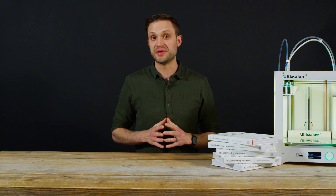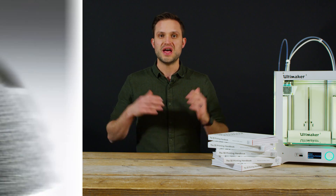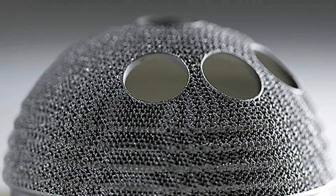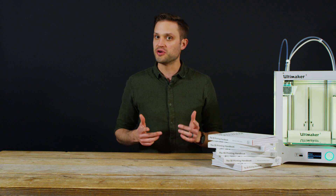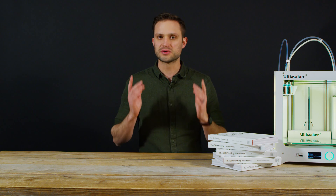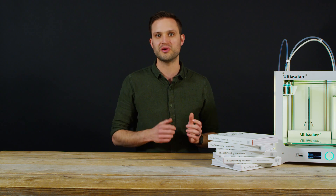So let's do a quick recap. Metal 3D printing is an industrial process best suited for complex high performance parts. It offers a lot of design freedom over traditional manufacturing techniques and you get all the benefit of your parts being made of metal. However, costs are high, build volumes are small, and parts require a lot of post-processing. It's also important to keep in mind that design is difficult and there's a large dependence on support structures to ensure you get a good print.